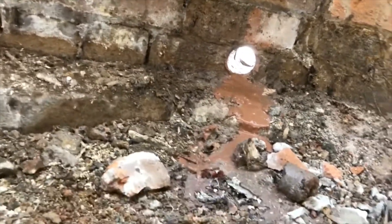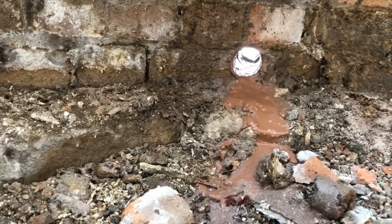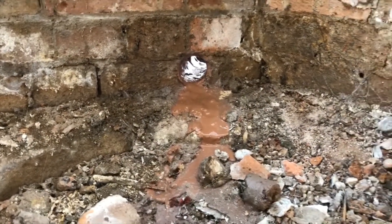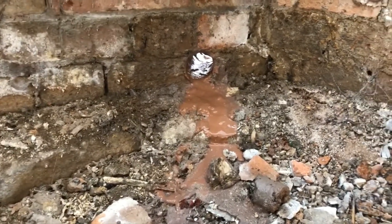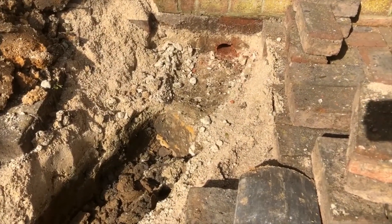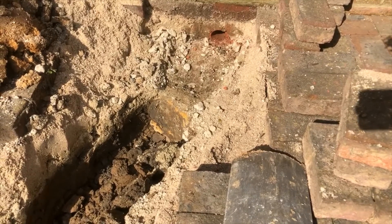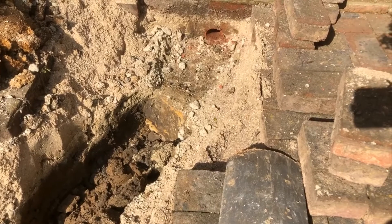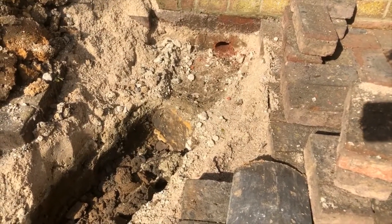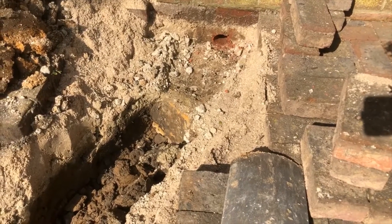After my SDS drill went pop — and frankly I'm still grieving about that — my little normal hand drill has done its magic. Rather curiously this has popped through and I wasn't expecting it to. I was expecting it to go through the foundation as we had with the metre bit, so the fact that it suddenly appeared into daylight seems rather odd. Well, you can see it's popped through just above the foundation of the house, which is what I kind of thought inside. That's similar to the incoming mains cable for the house. It's fine in terms of current UK regulations in that you're burying to the depth of likely disturbance, but I'll be taking it deeper as soon as I can. I'll be chopping out some of the foundation to take the duct around there, and obviously the duct will protect it too, and it will be taped and marked.